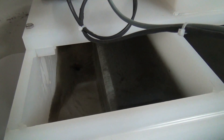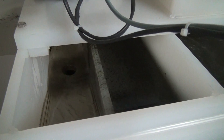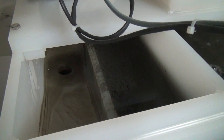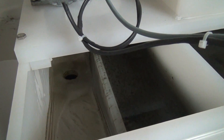As the water flows through, we'll go through a series of weirs and overflow the weir, where we'll separate out the flocculent from the water. The floc you see here contains all your metals, suspended solids, and all the contaminants in the water.